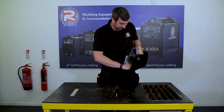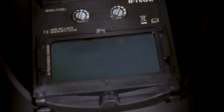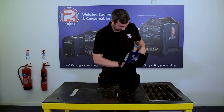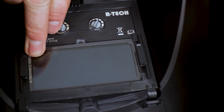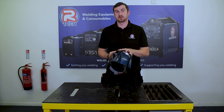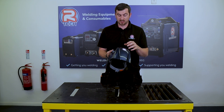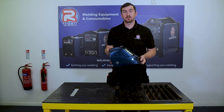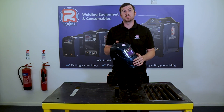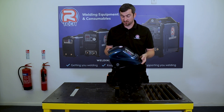For the inner lens, there's a small divot for your finger at the top — get behind there and pop it out, then reverse that to place the new one in. This is vital protection for the darkening filter itself from spatter or debris, so you want to change them fairly often so you can still see exactly what you're doing. That's the Speedmaster 2 — plenty of features, great value for money, and a good all-rounder.